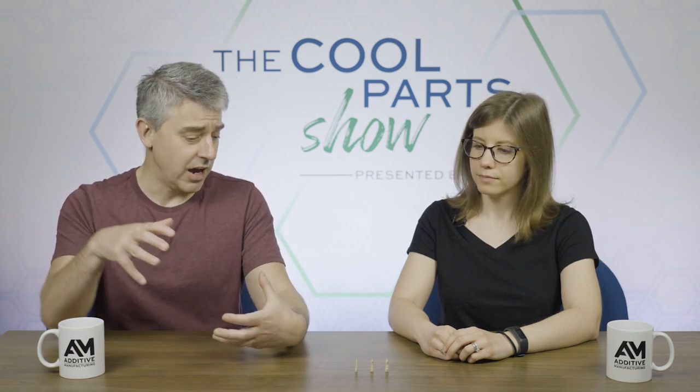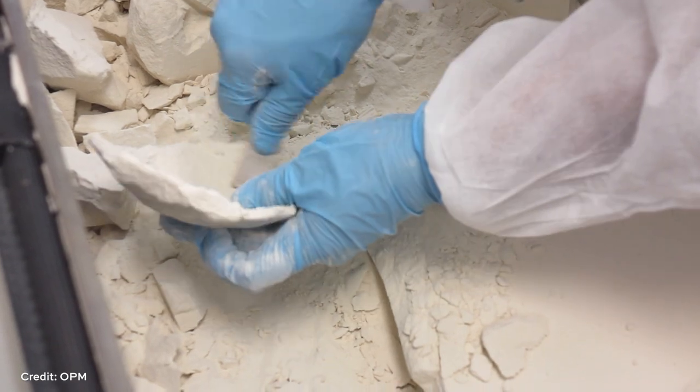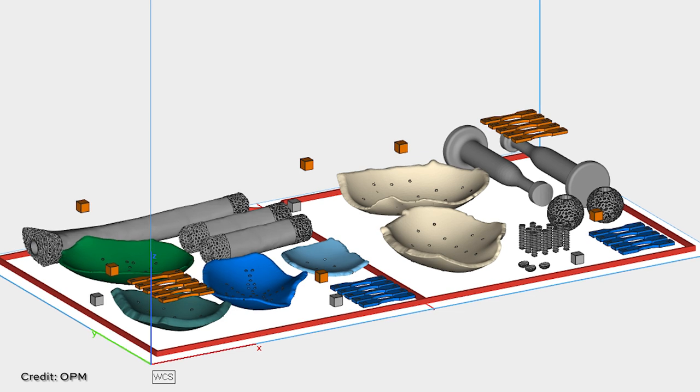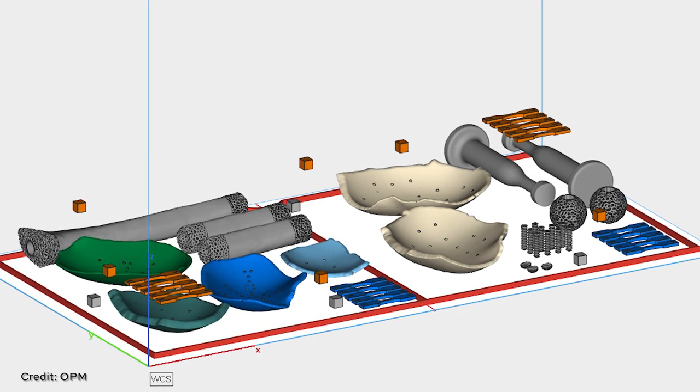These suture anchors are 3D printed, selective laser sintering, in a batch of about 600 at a time. The build takes about 12 hours. The parts are pretty much complete after 3D printing, and that build of 600 could be any combination of suture anchor designs. It doesn't have to be all the same part. So this opens up a couple of possibilities. One of them is manufacture at the hospital. Don't wait to order and then ship and then store anchors like these. Instead, produce them as they're needed at the point of surgery.